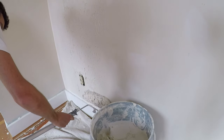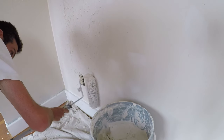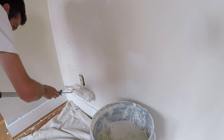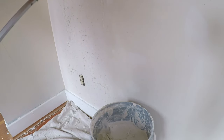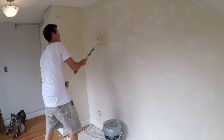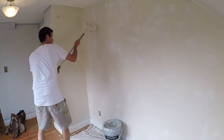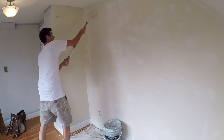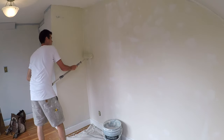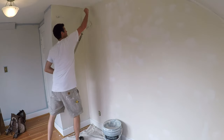That's one of my favorite things about this method. Even though I find it kind of messy and I don't like having to have other tools handy, it just seems to be a really nice finish. I want to get from floor to ceiling coated. You can get surprisingly far with this method — like four by eight feet pretty easily. Or if you have two people with one running the roller and one running the knife behind, it can really go fast and do good results. Just make sure it's not drying out on you — that's your limit.